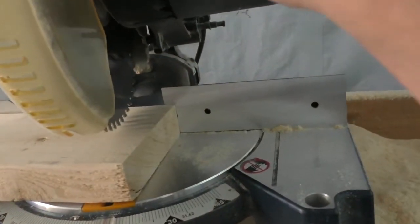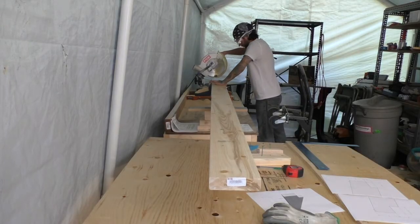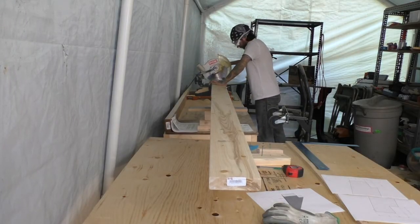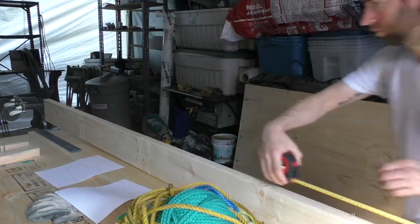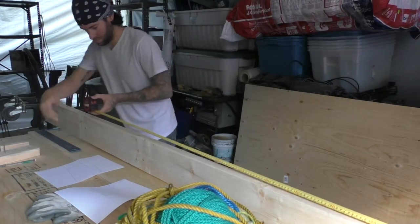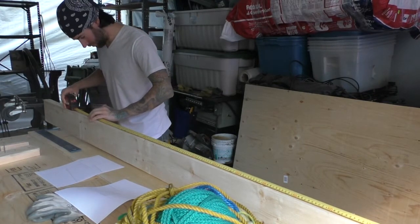The first thing that had to be done for the roof rafters was cutting them to size with the correct angle on the ends. Like the rest of the house, we needed this cut to be at 10.4 degrees. We set up the miter saw and cut every rafter to length. We got that length straight off the SketchUp model, since the top plates had worked out perfectly.